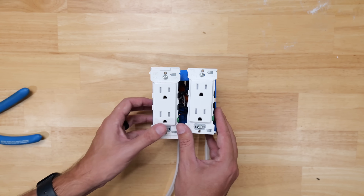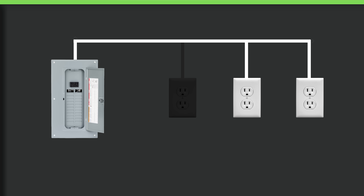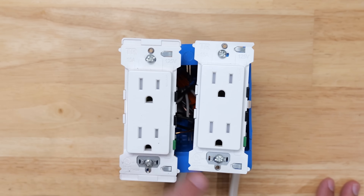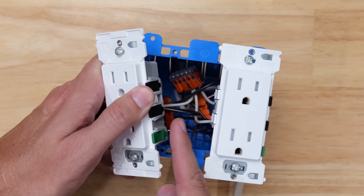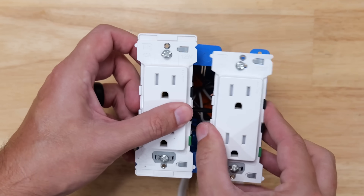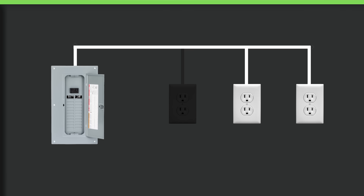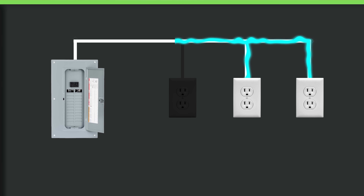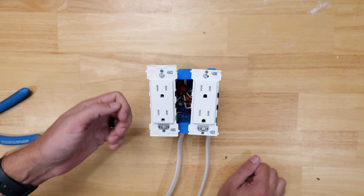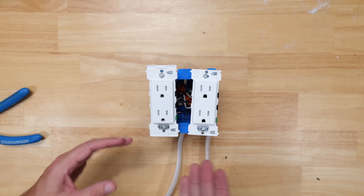So what's the purpose of wiring this way? If the upstream receptacle goes bad or stops passing current, everything downstream is still getting power — because we did not connect the outgoing power through the receptacle. We're using pigtails and connecting all wires together in the box, so current always passes from incoming directly to outgoing, completing the circuit. On top of that, because we're not relying on upstream receptacles, the downstream ones receive a steady, regular voltage at all times — even if something upstream kicks on hard and pulls a lot of current.